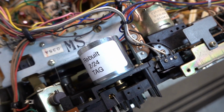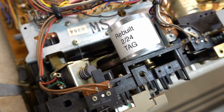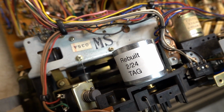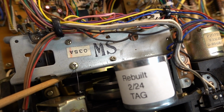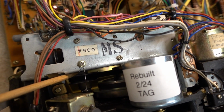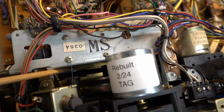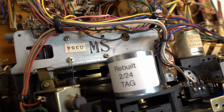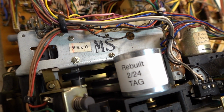Okay, so we went over the mechanism changes that need to be made. Also, I don't know if you'd be able to tell, there are some set screws behind the capstan. It's part 58. It's right behind the capstan. These sometimes break, and these were both broken. I repaired those. So that takes you on a tour of the inside.